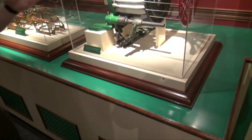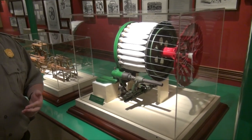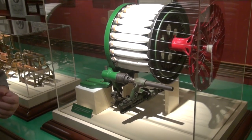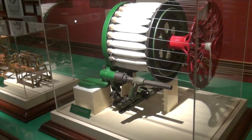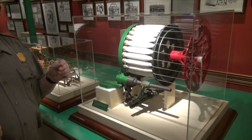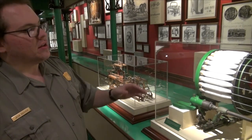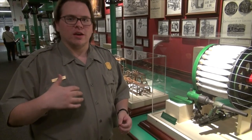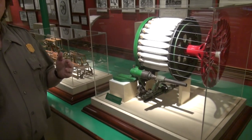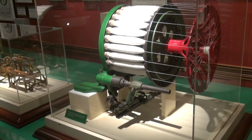All of these bobbins are lined up around 24 of them on one battery. One of the most frequent jobs you would have as a mill girl or as an immigrant worker in the factory was to take the bobbin and change it out, because it goes through the Weft thread so quickly — around every five to six minutes you need to change that bobbin. Instead, the very bottom bobbin gets knocked into place, simultaneously knocking out the old bobbin and automatically threading itself with a new shuttle design. This took that job away from the worker, helping facilitate a switch from four to eight machines per worker up to 16 to 24 machines in the 1900s.